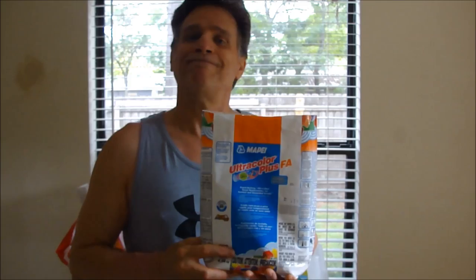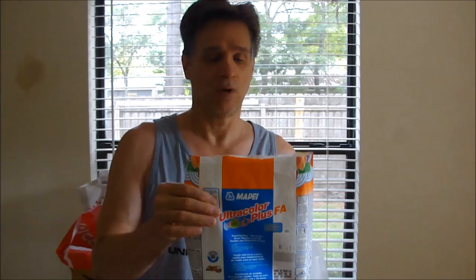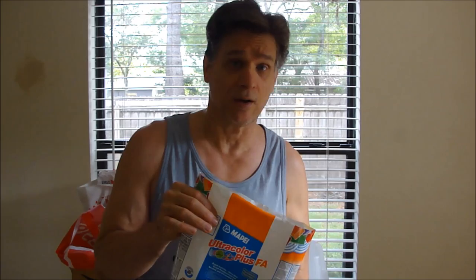So there's that. And then how much water you mix, right? Don't mix to a certain consistency. Don't do that. Don't try to guess. You'll wind up adding too much water. It's always going to be too much because it takes time to mix. So this is a 10-pound bag. The manufacturer says you mix 1 to 1.1 quarts, which is 32 to 35 fluid ounces.